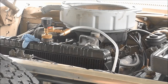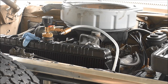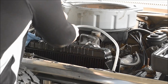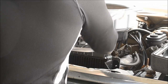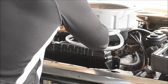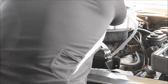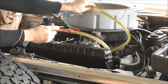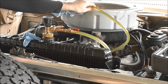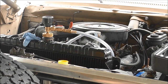So then we'll go on to the next step. That was the hard part. Now we're going to swap over the hose for a suction hose and pull coolant out of the drain pan that's sitting on top of the air cleaner. We're still not quite full, so I've got a bottle of antifreeze sitting in the engine compartment — you can see just the tip of it sitting there next to the box in blue. We're going to go ahead and finish off with the fresh antifreeze.